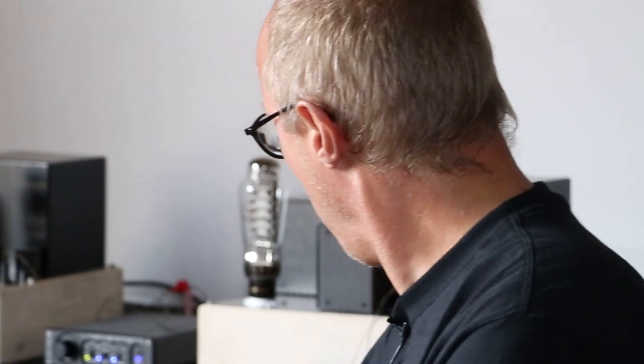All this wired with self-made cables, and I brought a pair of monoblocks using the Emission Labs 20B as a driver and the 1605 as a final stage. It's a Sakuma style amp, so there is no capacitor in the signal path, only transformers, lots of transformers. I call it the Iron Hog. And additionally, I have also RCA wiring, self-made. A friend of mine, Franco Laskowski, is doing them.